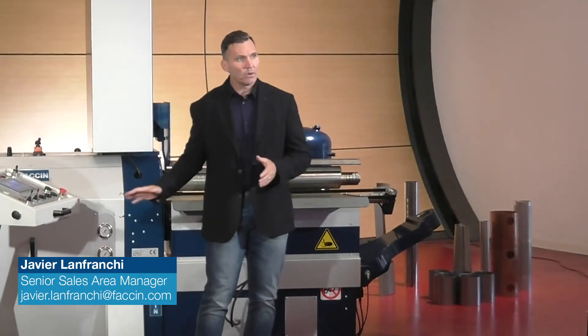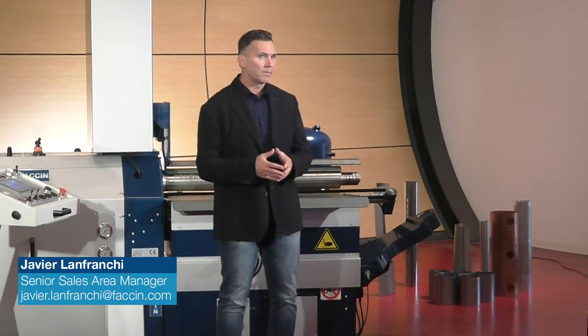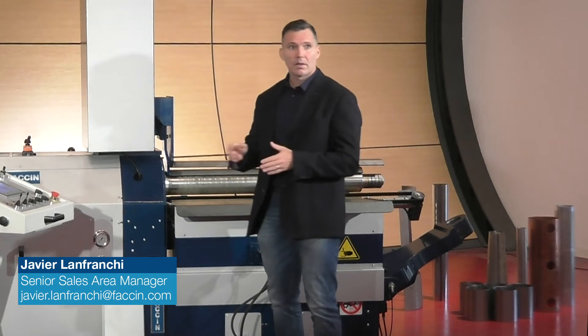We would like to show you a video from our showroom of the forming of a cylinder from an HCU with the use of only a shaft. This is a plate roll of 1 meter in width, for thicknesses up to 3 mm in mild steel and 2 mm in stainless steel. It has a basic configuration: top roll with pre-loading system, Siemens control panel for the automatic management of all the digital axes, and top support with double independent arms for the oscillating cylinder and the spindle pipe.